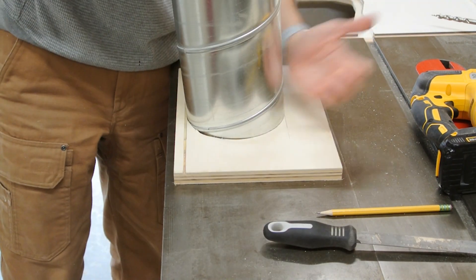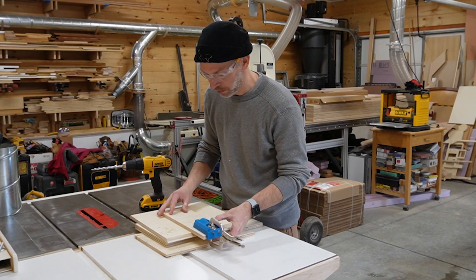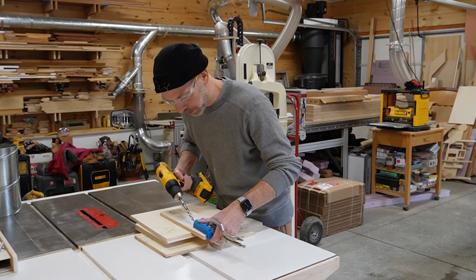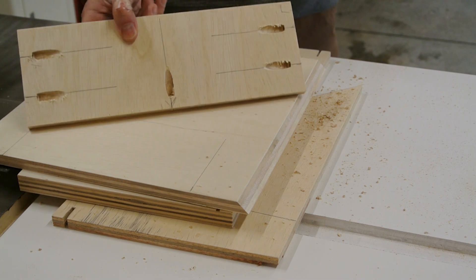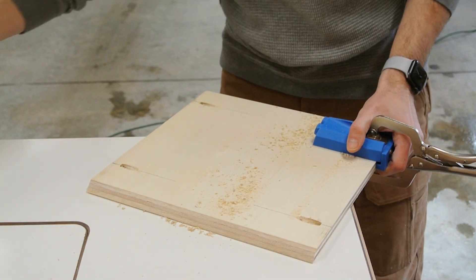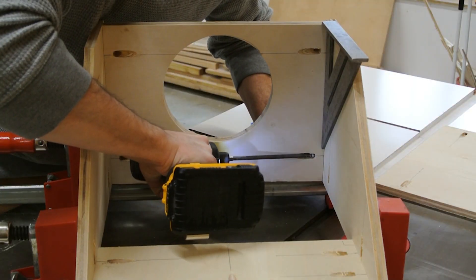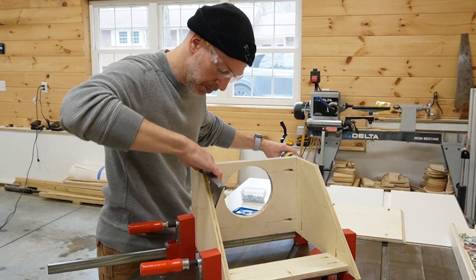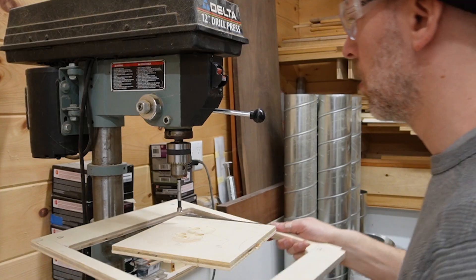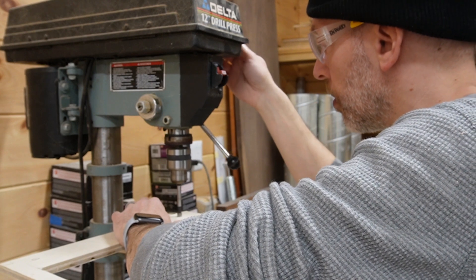Afterwards I used a file to approximate a helical groove that would allow the spiral seam in the duct to fit. It took a little bit of persuasion and a few karate chops but I got it to seat in place. Since this is really just a glorified lightweight box I cut pocket holes to prepare for assembly. For aesthetic reasons I chose to keep most of the holes on the inside. While assembling the box I used a speed square, a spacer block, and a few clamps to make sure the duct chute didn't get out of whack. Before mounting the top flange I drilled holes for the four bolts that would hold the chute to the table saw.